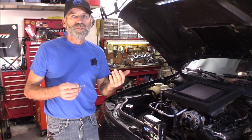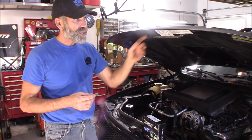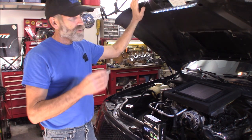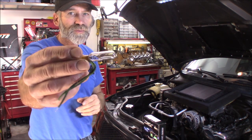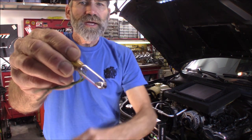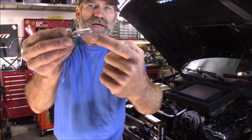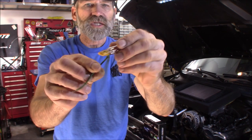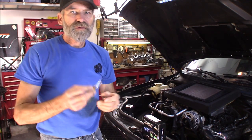One of the first things I had to do was install some type of tip switch or mercury switch, so when I pull the hood down it shuts off, and as I raise the hood it comes back on. What I used is this mercury switch. There are two contacts right down in here. Let's say you installed it at that angle — as you lift the hood, that mercury slides down and makes contact with the little metal probes in there, completing the circuit through these leads.